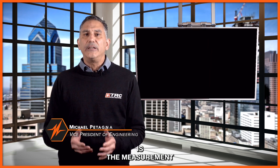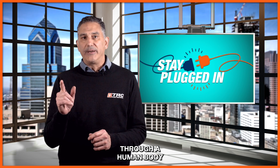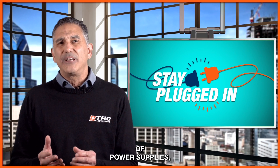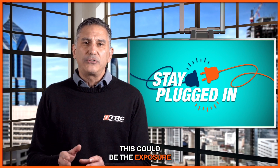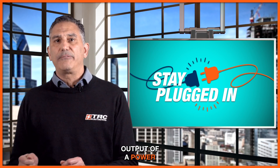The basic definition of touch current is the measurement of electrical current that would pass through a human body when it touches one or more of the electrical parts of a power supply. In many cases this could be the exposure of a conductive part even on a low voltage output of a power supply.